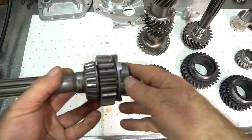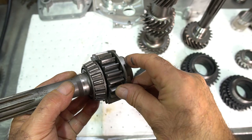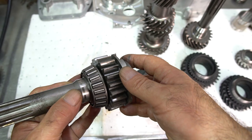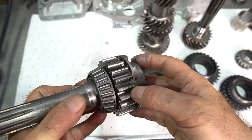This is a racing gear set from an old T5 transmission. When you first look at these gears they may look okay, but look at the pitting on the teeth. Not all gears are through-hardened — they usually only have a case hardening, and the case hardening depth is typically around 30 thousandths deep. What's happening here is the hardness is starting to flake off and spall off the gear. This could be wrong type of lubricant, too tight backlash — something happened, and it's typically a heat treating issue.